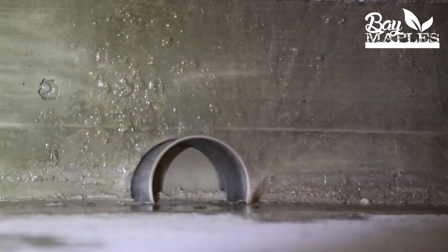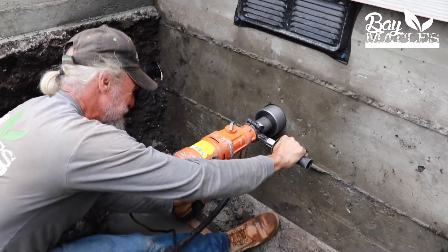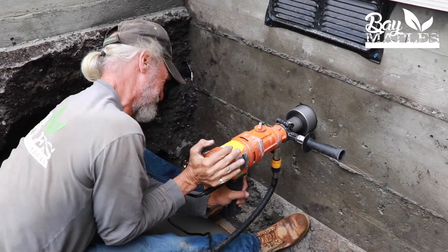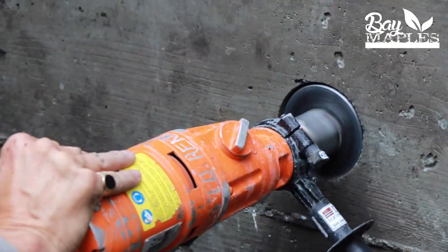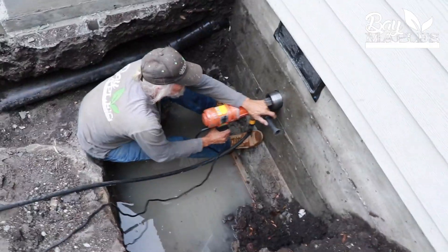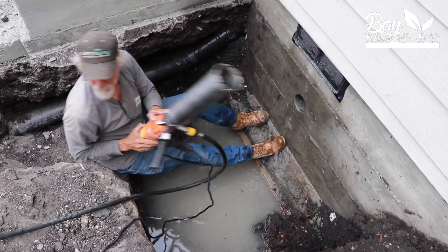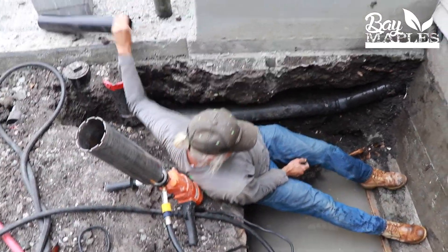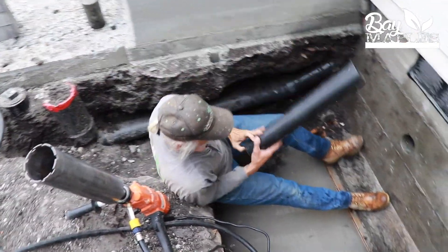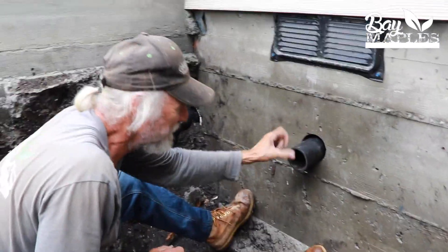The reason why we have this filter is that by filtering the water it allows you to have a lot more options in terms of how the water gets used. Most traditional drip irrigation systems will get clogged by gray water. This allows you to filter the water and send it through a traditional style drip line that you can incorporate in a variety of different ways. And by having the pump, it allows you to pump it to the front yard and also use it for the backyard — a much larger variety of uses for the water.